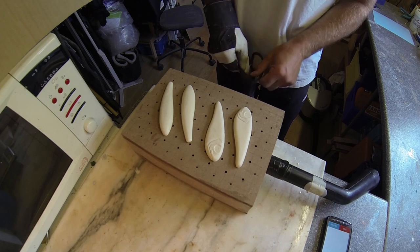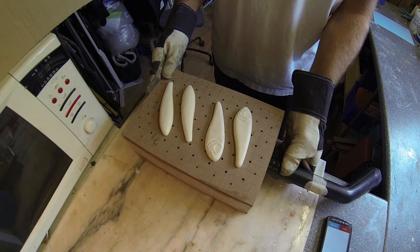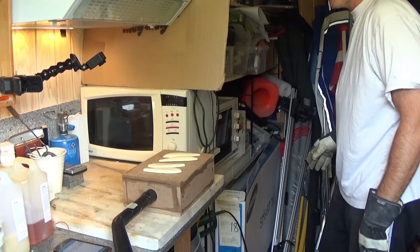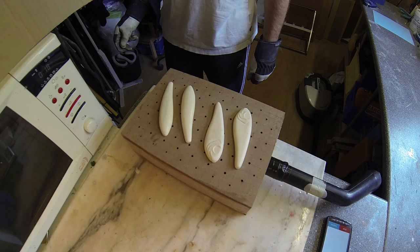Okay, I know it's a bit noisy now, but I've attached and started the vacuum cleaner, and I'm putting on my gloves because the frame will be hot when I get it out there. So I'll just be waiting 40-50 seconds. When you look into the oven, you might be able to see the plastic starting to hang down. I won't give it much more than 40 seconds. Okay.